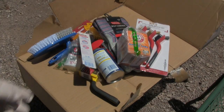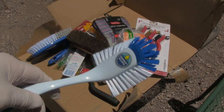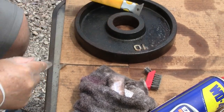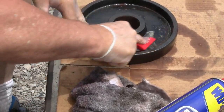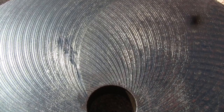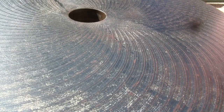Some folks say you want a brass or nylon brush because steel brushes are harder than the iron of the plates and can scratch them. For a while this didn't seem to hold true for me — I was cleaning plates by hand and the steel brushes didn't seem to harm them. I presumed this was more a concern with a power drill's intensely spinning steel brush, but then on one plate — an old York that I cared about — rubbing by hand with the steel brush left noticeable scratches across the arcing milled grain. Be careful; it could be an issue for you.